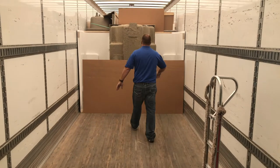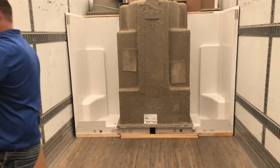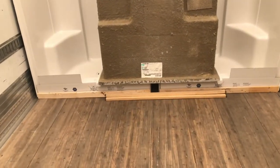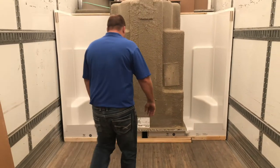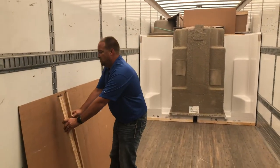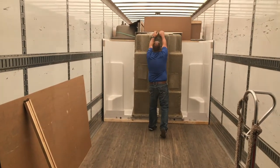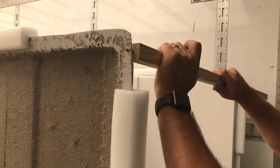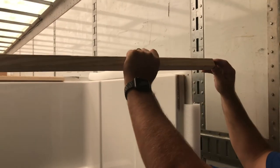You will need spreader boards for interlocked units. For those units, the spreader boards — a group of two to five boards — will be located against the floor of the trailer at the bottom of the specific row of interlocked units. Each row will have the same number of spreader boards as there are showers. We recommend to first pick up the spreader boards and move them to the side. Then, as you unload the interlocked tubs, attach the correct size spreader board to each shower as shown before storing the units. The spreader boards are used to prevent the sidewalls of the showers from bowing and cracking.